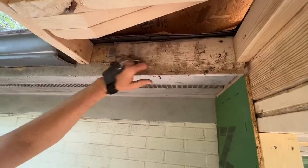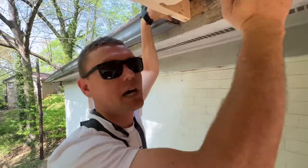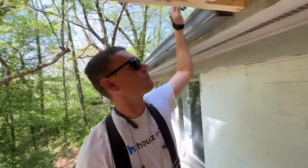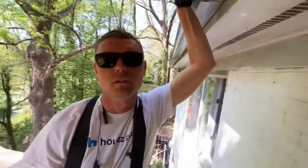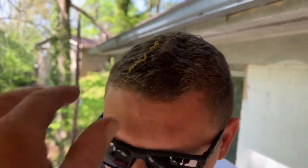This house used to be white. We're going to figure out the intersection of the new soffit and fascia with the old soffit and fascia. Ideally everything lines up perfectly, but in the case that our new soffit is slightly higher or lower, we're going to leave the bottom of the old fascia board sticking down as a break. If there's a slight difference, you won't see it — it'll give us a break. Our heights were supposed to be the same, but if we were off even a quarter inch and you just butt the new soffit finish material to that, it's going to look like a quarter-inch jog. This is just an easy, clean way to do it and it'll look good.